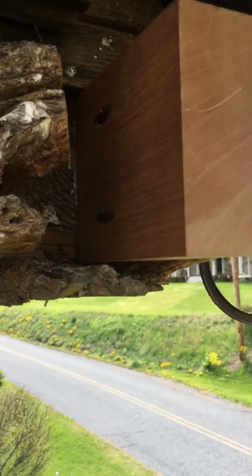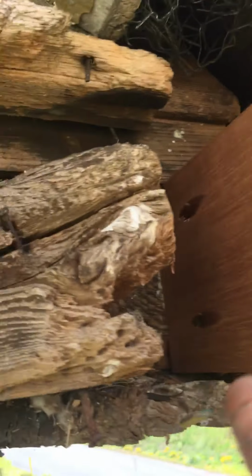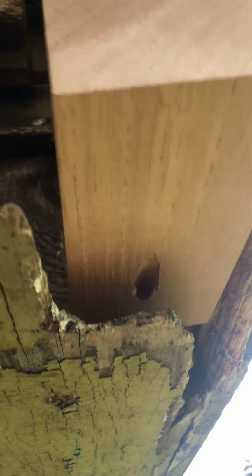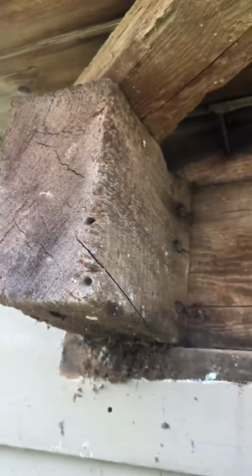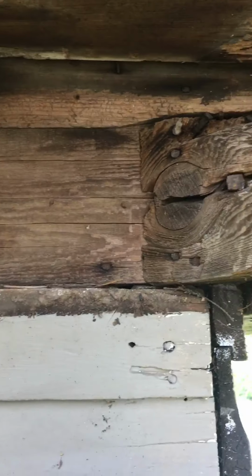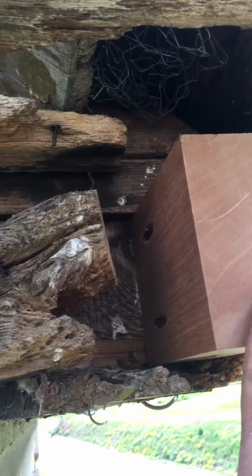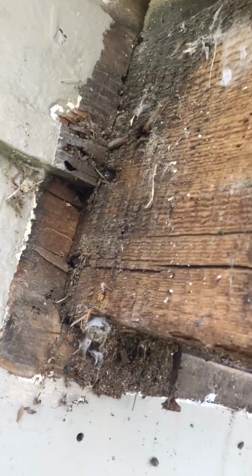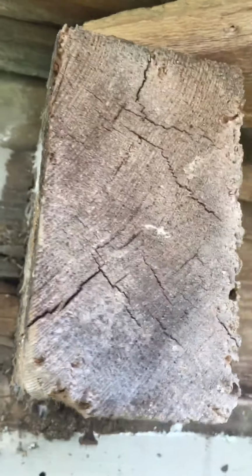But anyways, so I'm at the stage now where I just took some of this Spanish cedar and screwed that in there. I used Kreg system screws to attach that. It's basically doing the same thing this is doing. I'm gonna have a board that spans across here, and then cuts back in and gets coped along the back edge there. So that goes around. And then the final thing is to take some crown molding to go across the top.